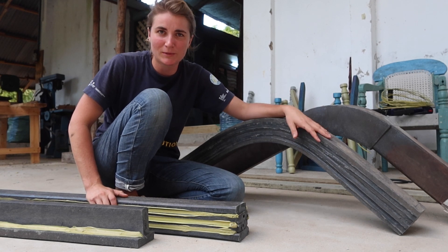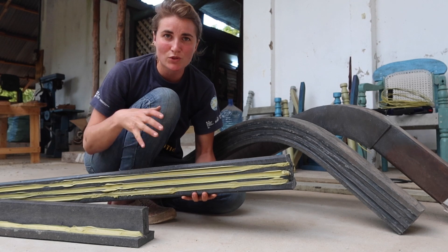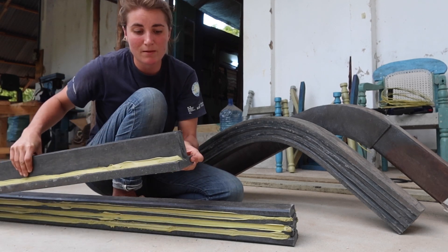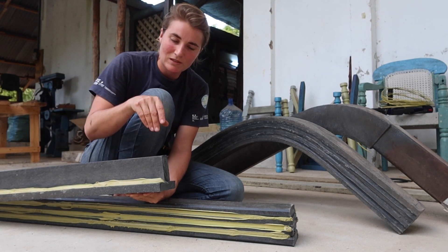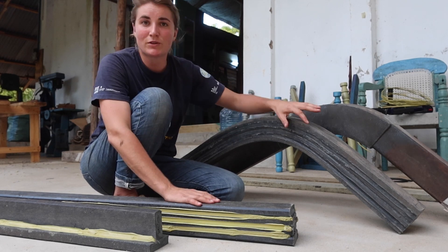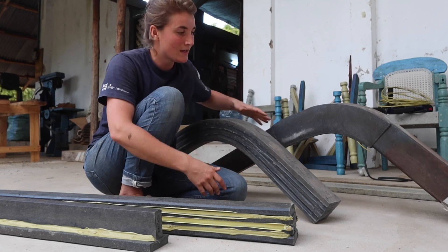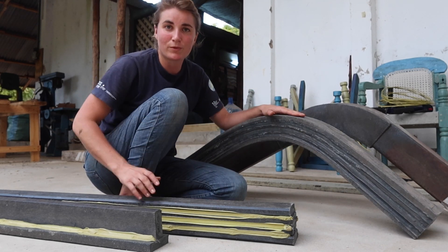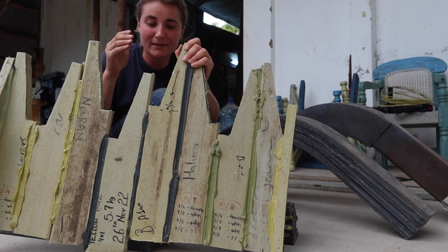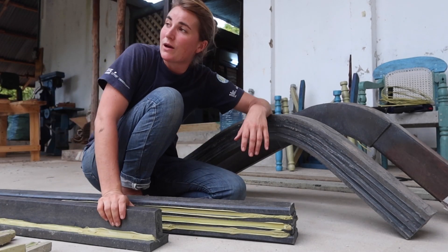This was to show you just a few of the possibilities of what you can do with plastic welding. We have our straight pieces where you use the same profile, laminating them into one fat piece for bigger construction purposes. You can make T-sections for more efficient use and a very strong profile using the vertical strength of another piece. You can even do round profiles — by bending your planks and welding them together you can create more custom and organic shapes. Here you see a piece which was extruded into a mold, and the same shape laminated with normal planks. You also have the joining of different planks — instead of adding nails in between, you can weld them and it makes a really strong bond. And of course for sealing the boats, that's something where we want to use it quite a lot.